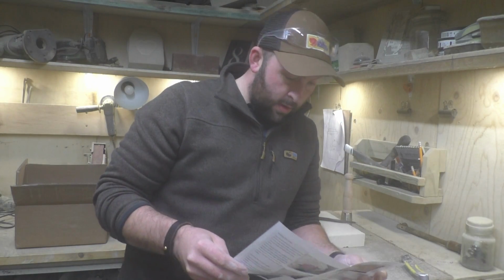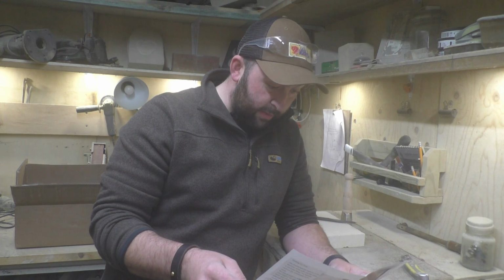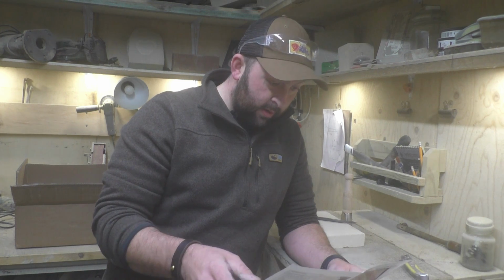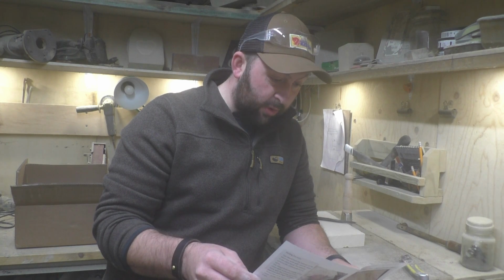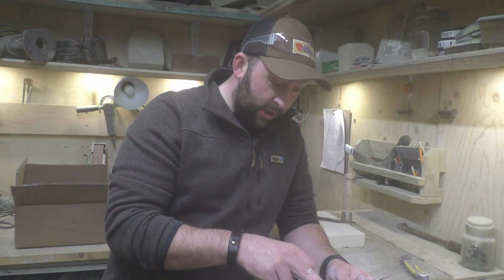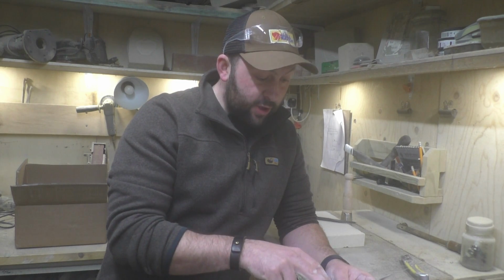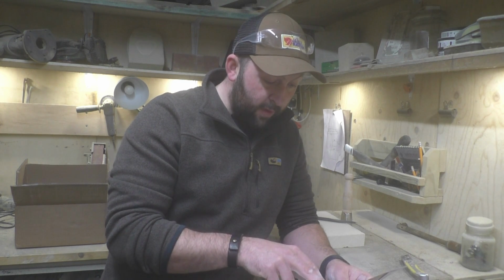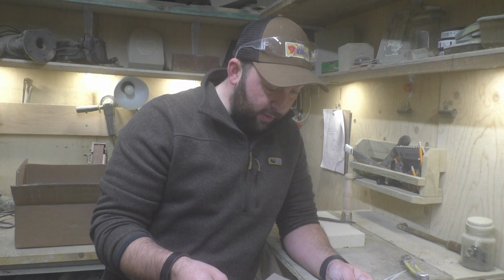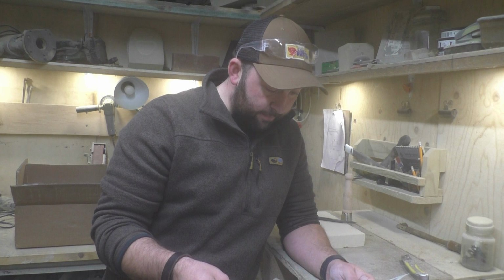Oh, so it says here polishing the top off with a piece of sandpaper. So we've got section 1, prepare your working area, placing your stone block on a secure workbench. Number 2 is like we picked up straight away, where we said there were some saw marks in there. They've addressed that here by using a fine sandpaper around 120 grit, sand the surface until smooth and dust off with a brush. Number 3, place the carbon paper onto the stone and the template over the top, mark it out, trace over the top using a pencil.